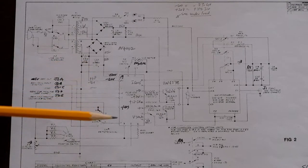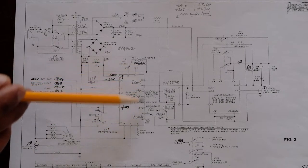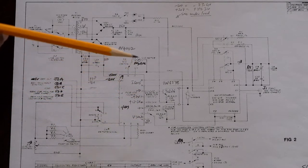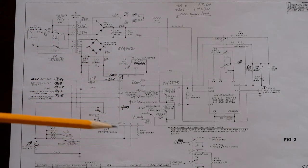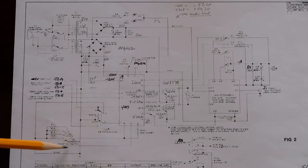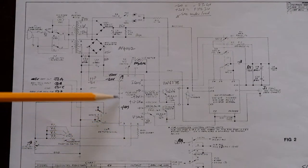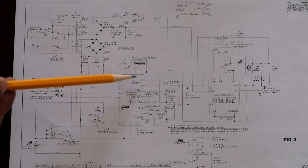There's also the main control board here, called PCB 100. It has inputs for the control voltage coming off a resistor — this is the adjustable front panel 10-turn 5k resistor. On other units with higher output supply voltages there's also a selector switch with multiple positions. My unit is the 210-01-R, which does not have that option.